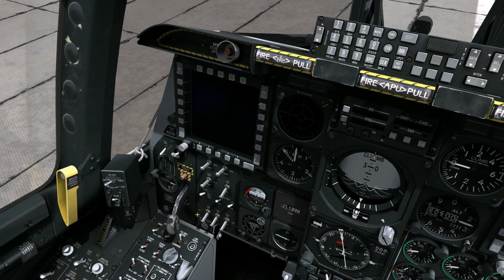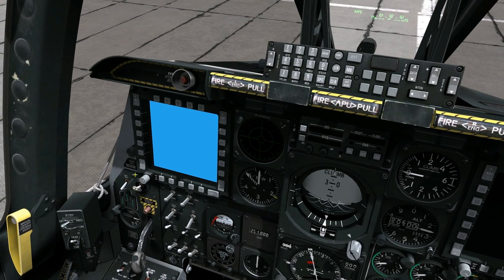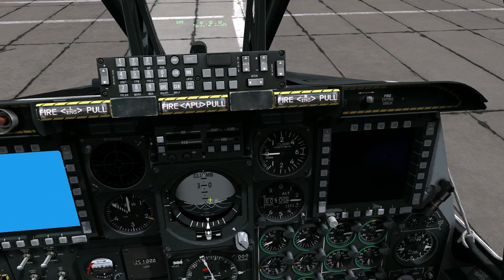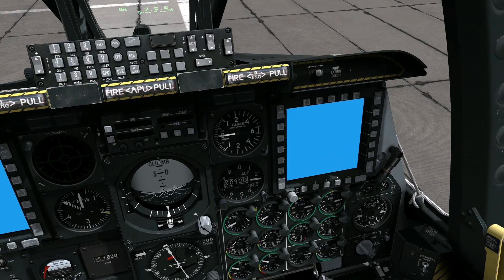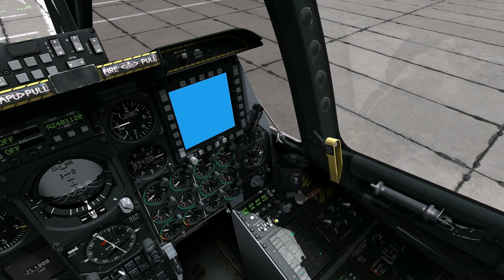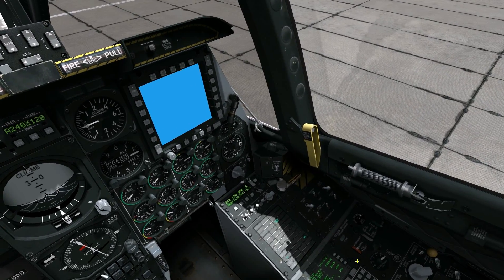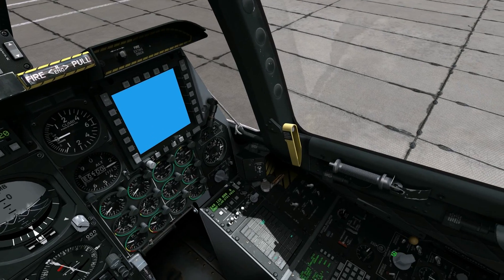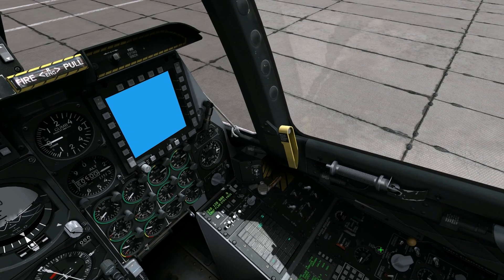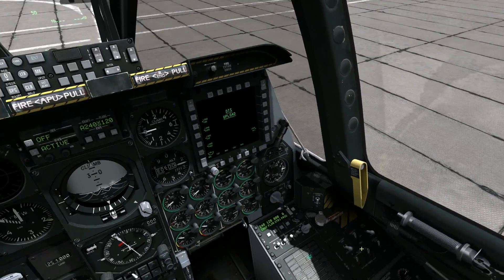Now I can concentrate more on what's inside — continuing around. These three switches link the fire control systems, the various computers, the HUD, and the navigation system. Turn the display on — we want day mode. Anti-skid can go on. Turn this display on and zoom out a little bit. Continuing down here, we can turn the countermeasures on to standby should we wish. Next thing to test is the oxygen system — there's a little button down here. Press and hold it, the needle sweeps round, and an audible and visual warning comes on. When you release the button it should reset and be fine. The oxygen is now on.